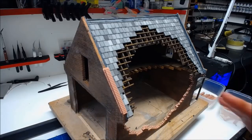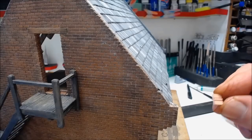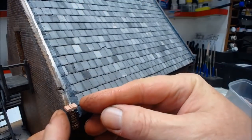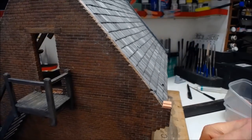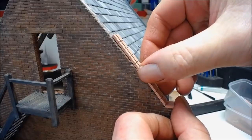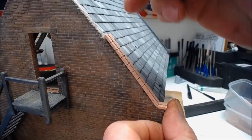I'll get the camera in position so you can see. For the little one-course corbel, I've cut just one piece off for the bottom — it sits with the queen closure in the middle, just a few mil either side of the actual wall. The second piece I've sanded a slight wedge so when we put it on it comes down and makes a nice little joint.